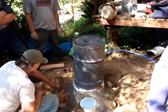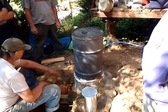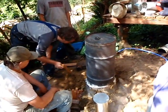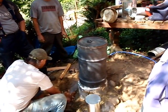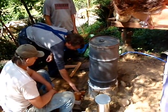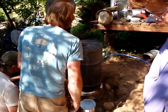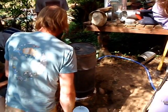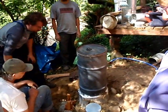So why the difference? Speed — the one in Coquille is an office. When you light up the stove, you want quick heat, and the person using the office wants to make tea relatively quickly. This one gives you a little bit more time with heat collection and puts a little bit more heat into the bed. We're almost at burner temperature — about 400°F. Fahrenheit 451. At that kind of temperature, can you boil water on it? Yeah.